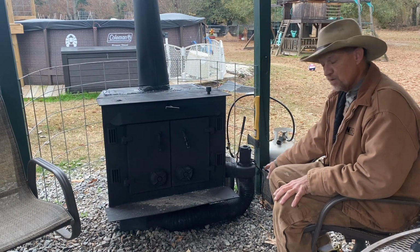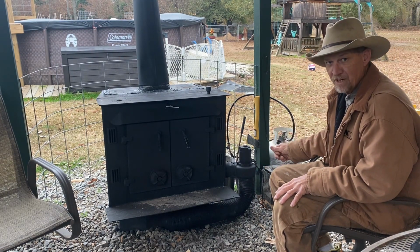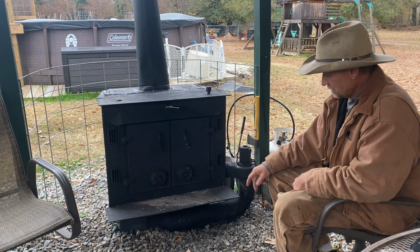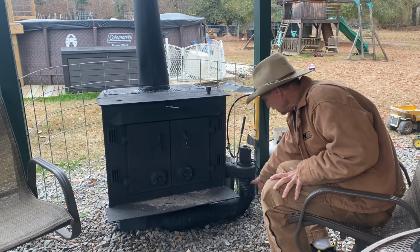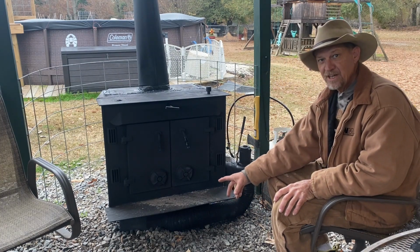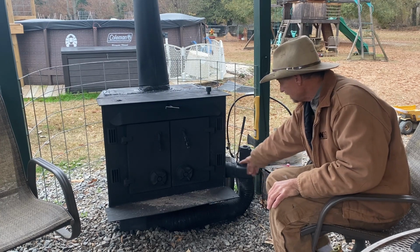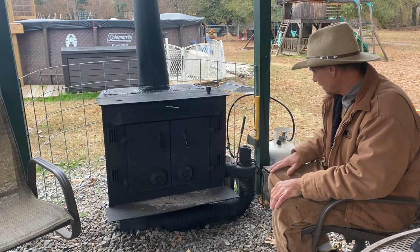And what I did, since I'm outside, you don't want your motor sucking cold air. You want it sucking warm air, just like if it was in a house. Well, this insert is sitting about 8 inches off the ground on 2 cinder blocks. So what I did, I closed that in up under the bottom. And I took a piece of flex pipe, that metal dryer flex pipe, and it goes up under that heater in that enclosed spot. So that's hot air under there. So now my return air is sucking hot air, and then it's blowing in here, and in return blowing out even hotter air.